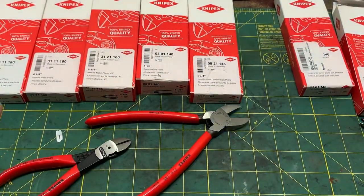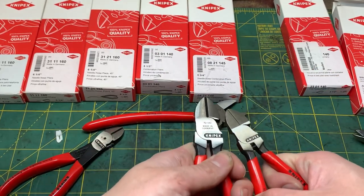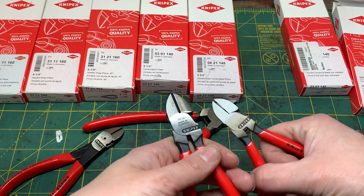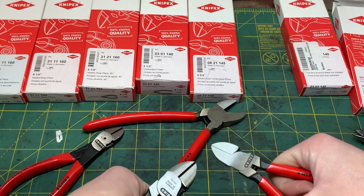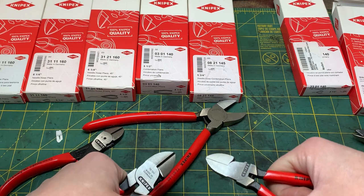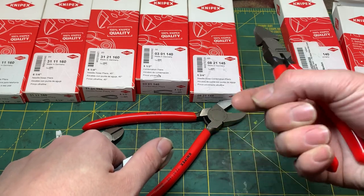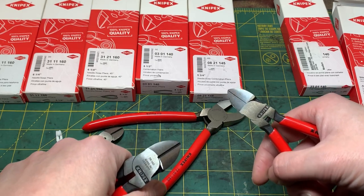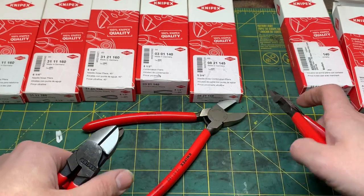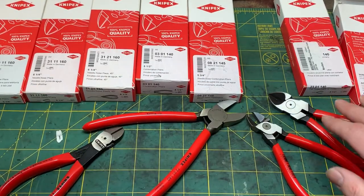Something to point out — I'm going to show you how familiar they look. Don't get confused when you're ordering these on the internet; they look super similar. These are both closed all the way. See how this one has that big old bevel in there — that's not a flush cutter. That will leave like an edge on a piece of plastic or a sharp end on a zip tie, where this flush cutter will cut it completely flush with no sharp jagged ends.